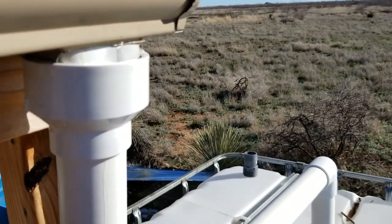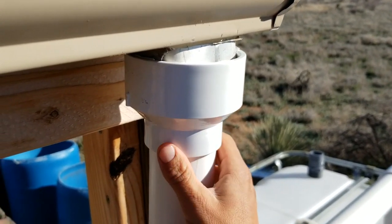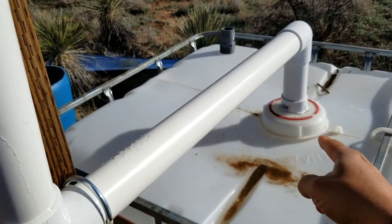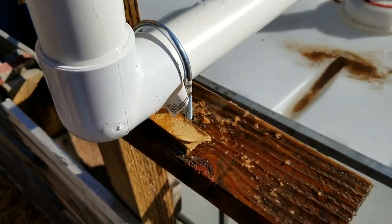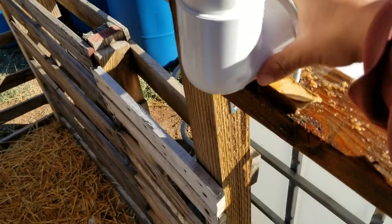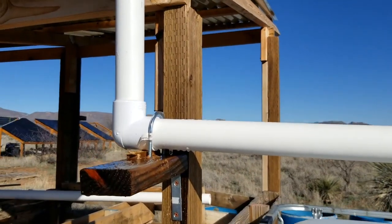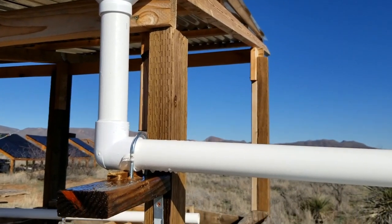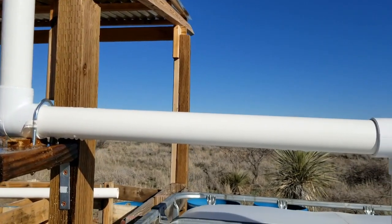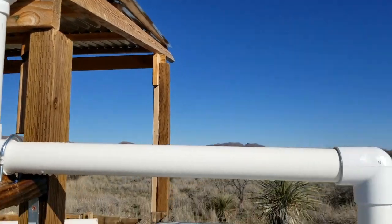We had to cut a hole under the bottom side of this gutter in order to get this downspout piece in, and all that's got to get sealed up so that we don't lose any water. The construction going from the gutter into the barrel is fairly simple — we just got some PVC pieces: a three-inch to two-inch connector going into a two-inch pipe, a 90-degree elbow, another two-inch pipe, another 90, down in there, and then a two-inch bulkhead fitting. I added a little piece of wood with a bracket underneath just to give it support, and a little U-bolt to keep the pipe from moving. One thing you'll notice is I did not add PVC glue — if this were going to be a permanent spot I would, but as this still may not be its final iteration, I thought maybe it would be good to go without it, just so that these pieces might be able to be reused. It's looking good though.